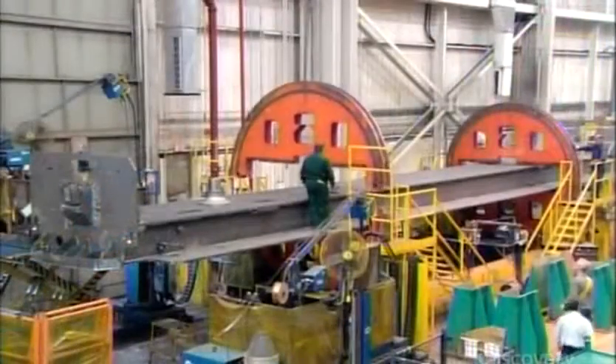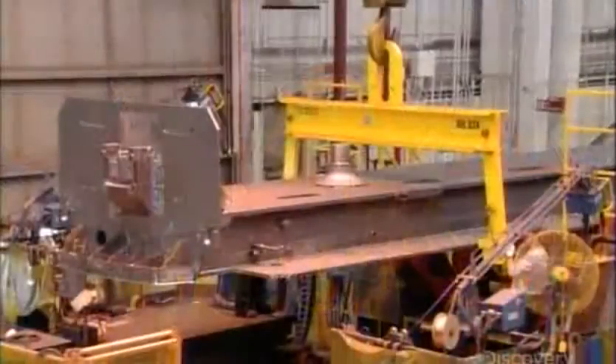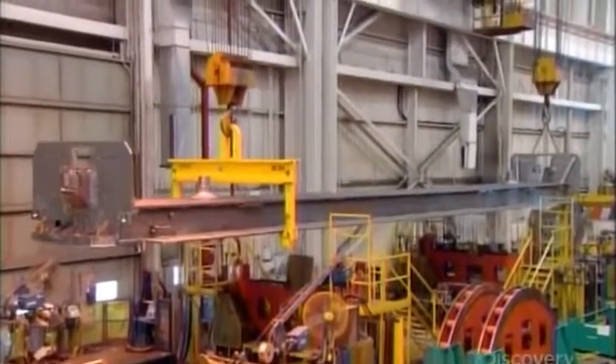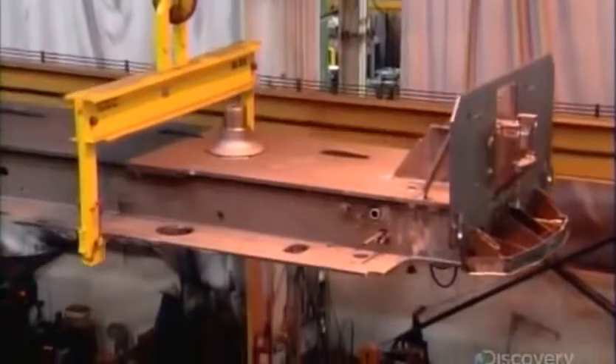Lifting and maneuvering it with giant trunnions, they flip the underframe so that the protruding side of the pins is facing upward. A crane system transfers the underframe to another area to complete the welding. The pins require exceptional bonding because they connect the underframe to the wheel frames.